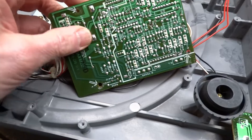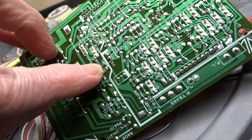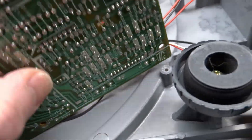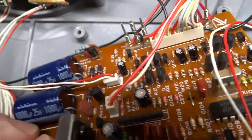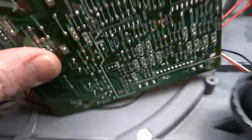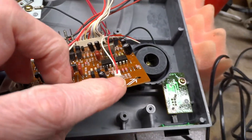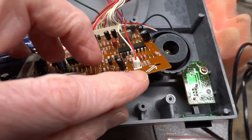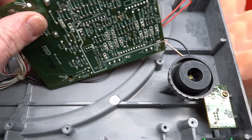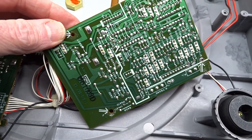On the plus side, everything here is marked. PS409 right there is your protector. It's nice that everything on the bottom is also marked. But unfortunately, contrary to appearances, these don't unplug — they are all soldered into the board. So you can unsolder them, or I'm just going to masking tape it down and work with it that way.